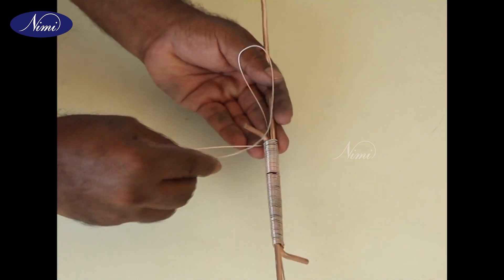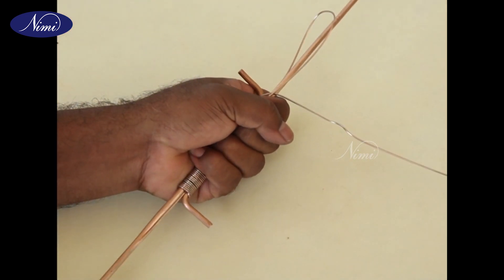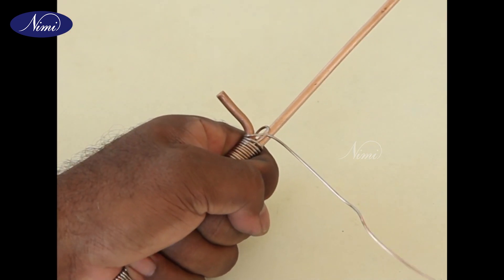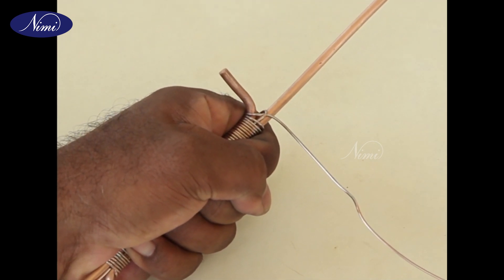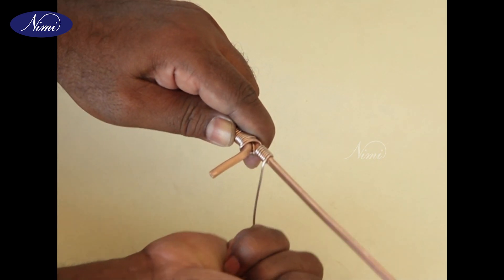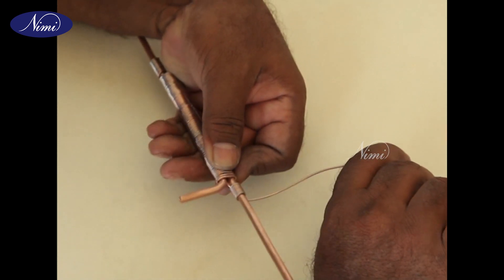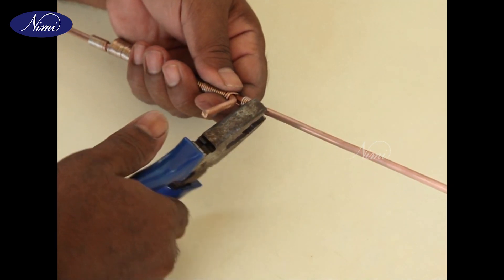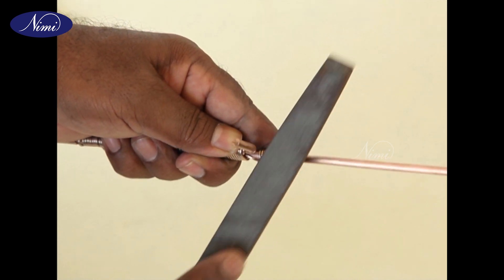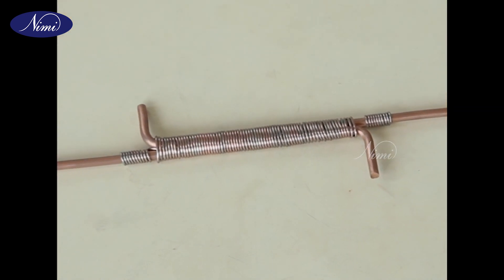Step 8: Insert the free end of the wire inside the loop. Step 9: Grip the 250 millimeter loose end of wire with pliers and carefully pull it so that the loop and the free end of the wire are pulled inside the wrapped joint. Step 10: Wrap the free end and the loose end over the conductors. Cut the ends with cutting pliers. Step 11: Press the ends of the binding wire with pliers to the conductors. Step 12: Smooth the sharp edges of the protruding wire ends with a flat file.